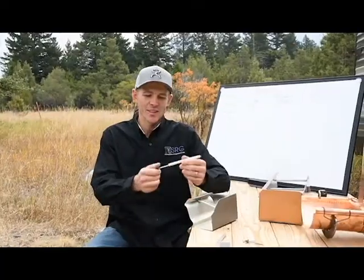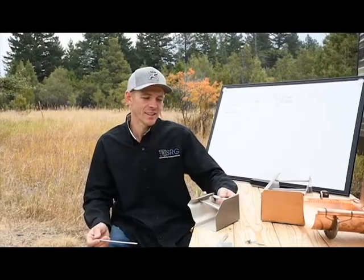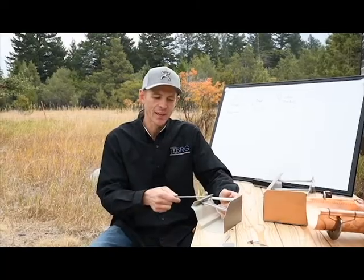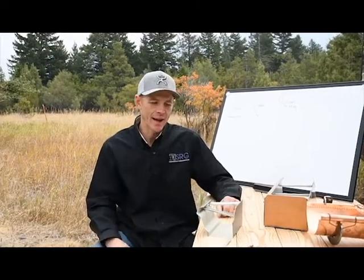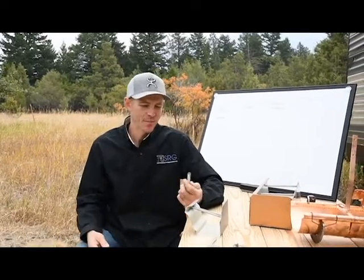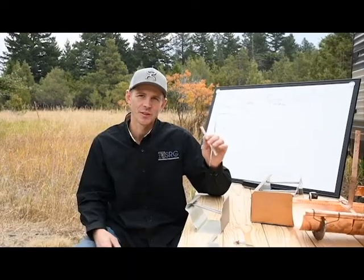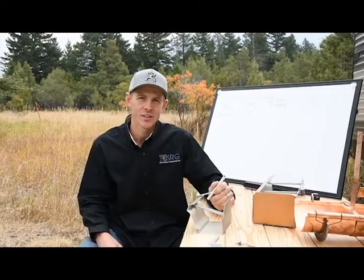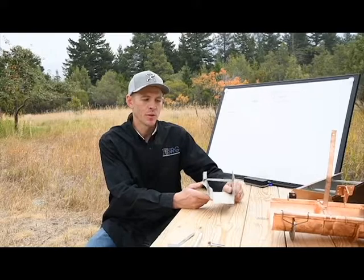This is kind of the old-fashioned way to hang a rain gutter — the old spike and ferrule. This slides into the gutter and then you use a hammer and spike it through the front and into the back. We don't ever use these; it's an old-timer setup. They're not adjustable — once you get that gutter pounded into the fascia, there's no going back.